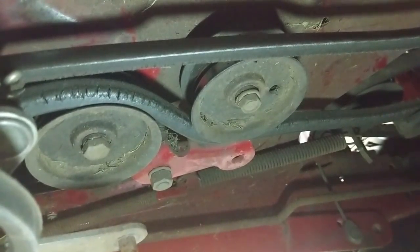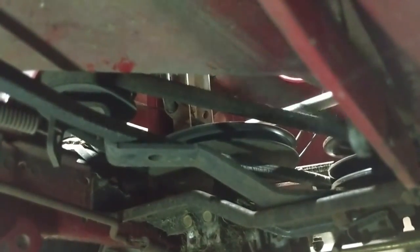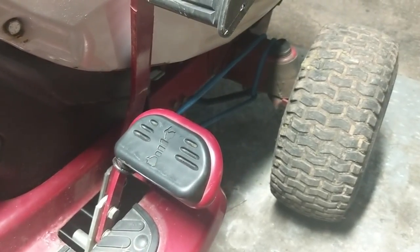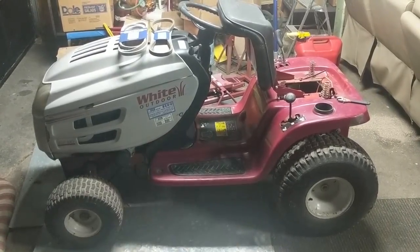I'm underneath the machine now, and this is our double idler setup for the belt drive system. This is your lower drive belt, which leads back to your stack pulley. From the stack pulley you have a second belt — the upper drive belt — and that goes to your transmission. That is under spring tension as well. The point I want to make is: you may think you have a seized transmission, but it may just be a seized pulley on your variable drive stack pulley. If it seizes in the upward position, this belt will have a lot of slack, but as soon as you press the throttle it engages the double idler, which puts tension on your belt.